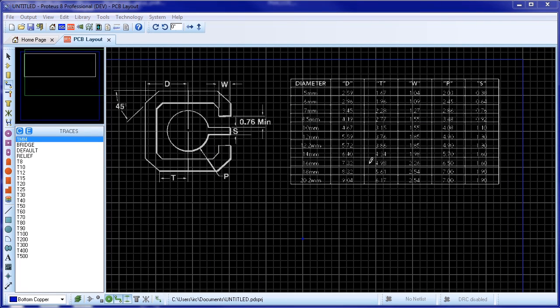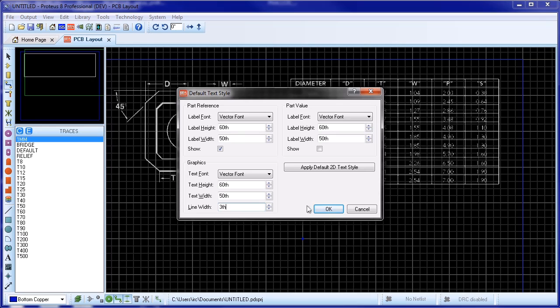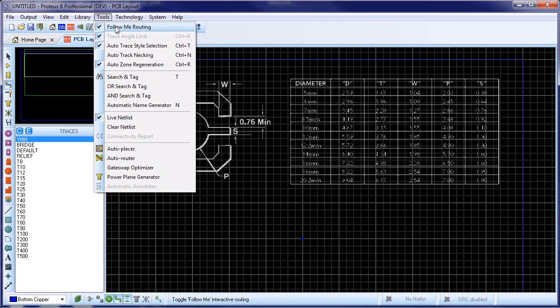Looking at the land pattern, we're going to need to draw some guidelines for positioning and routing. We'll modify the default graphic line style to be thinner and then use graphics on the mech layer as our guides. There are some fixed 45-degree angles on the track, so it will be easier for us to control with Follow Me routing switched off. Follow Me routing is ideal for tracking a board as it's more freehand and obeys design rules. In this case, however, we want to track strictly on a grid in clearly defined steps. Finally, we need to make sure that trace angle lock is switched on to ensure 45-degree cornering, and we should switch track necking off because we don't want to neck into the terminating pads.